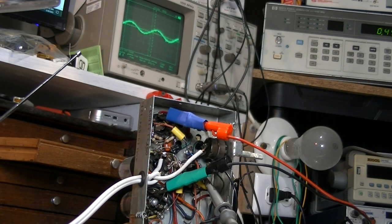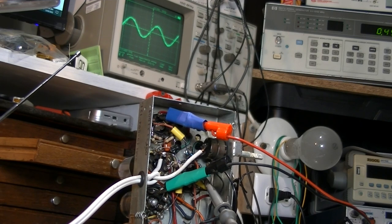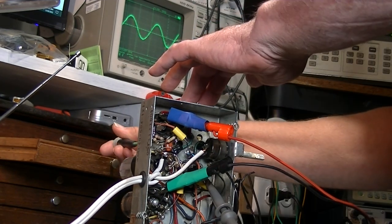It looks a little dirty and I think that's the resistor in that IF can. Let me bring the amplitude up - we'll go 50 millivolts. There we go, just a bigger wave. The signal generator is going to the primary side of the IF transformer and my oscilloscope is hooked up. Now that middle tap - put it there and you'll see the difference. It's showing 445 to 446 kHz, just fluctuating. The slug's working - you can see the waveform get bigger and smaller.